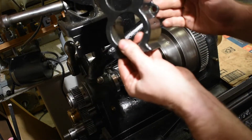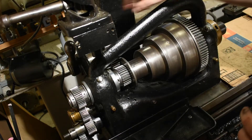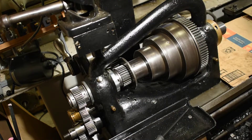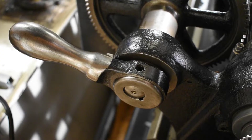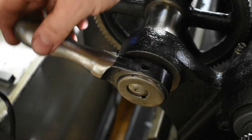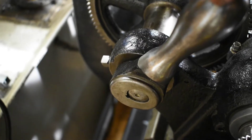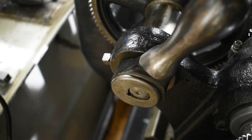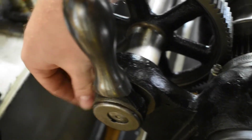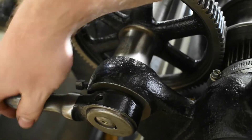Again, there's two screws, one on each side. The next thing we're going to want to do is remove the back gears — disengage that. The first thing you're going to want to do is loosen the set screw and remove it here. That allows this handle to come off the shaft. And then there's a limiting screw back here that limits the amount of motion you can get. It doesn't have to be completely removed, but you can back it out enough that you'll get more motion.